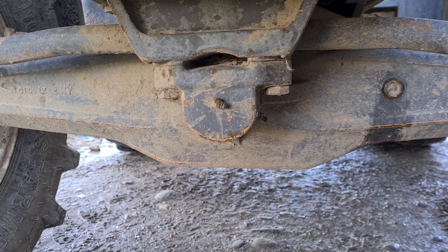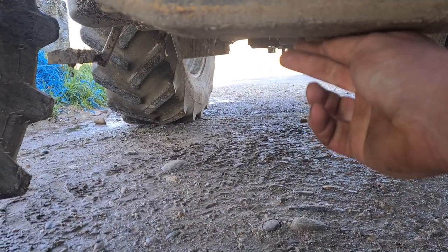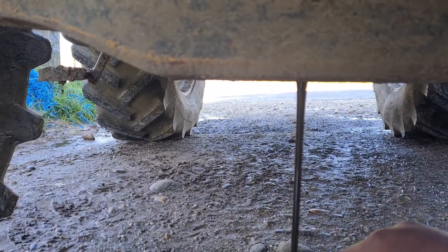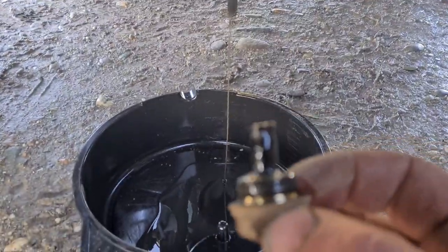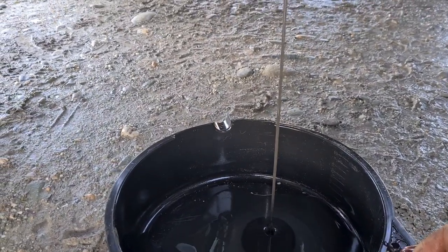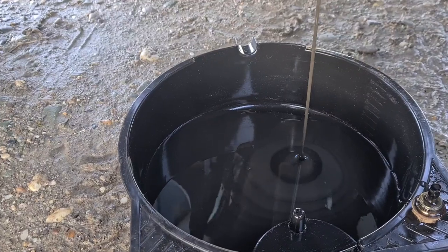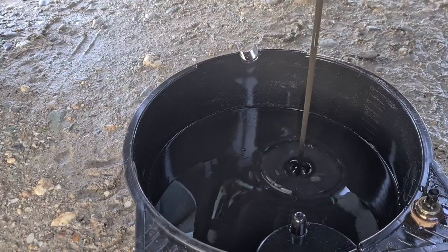The dealer has been told and they don't seem to care. When I checked it, it looked a wee bit dirty so I thought I'd just drop it out. It's done about 600 hours. Well, that didn't look too bad — it's a front axle. There's a wee bit of metal on there but nothing too serious. That oil is dirty and there is a little bit of a shimmer there that I'm not too keen on. We'll let it drain out and see what settles.